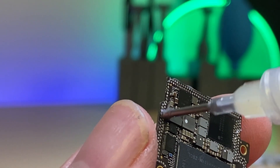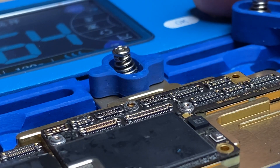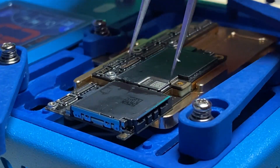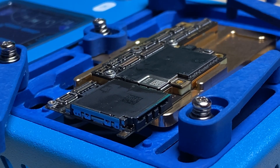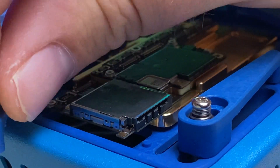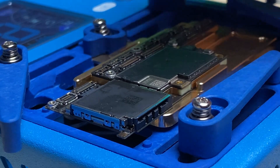Add a little bit of flux around the border here, and we will put the board back. I'm pretty sure that things are lined up and that it's settled. I'm going to let it cool down so I can look at it under a microscope and see if we've got good connections. What I'll probably end up doing is coming back, positioning these little arms to give it pressure, reheating it back up to temperature, turning it off, and leaving the pressure engaged while it cools down so that I know I have a solid joint all the way around.